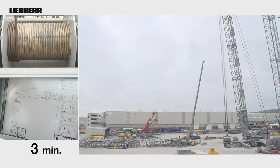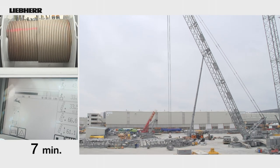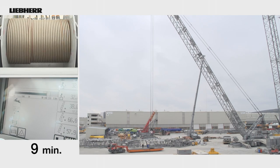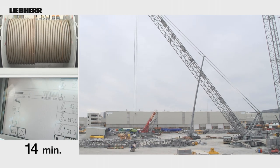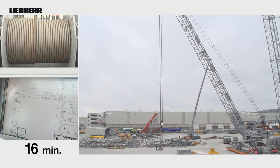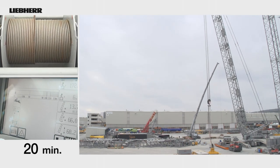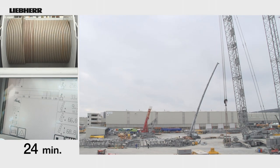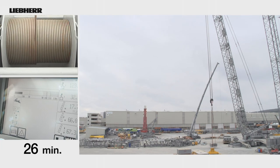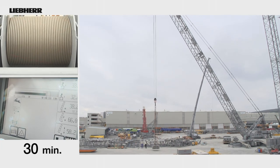On a lattice boom with a short system too, the radius is increased and the load repositioned. Once the load capacity limit has been reached, the process has to be repeated with extended attachment equipment as often as necessary until around 75% of the hoist rope has been wound onto the drum. Nothing else is required, since the other part of the rope is in use anyway for the hoist.